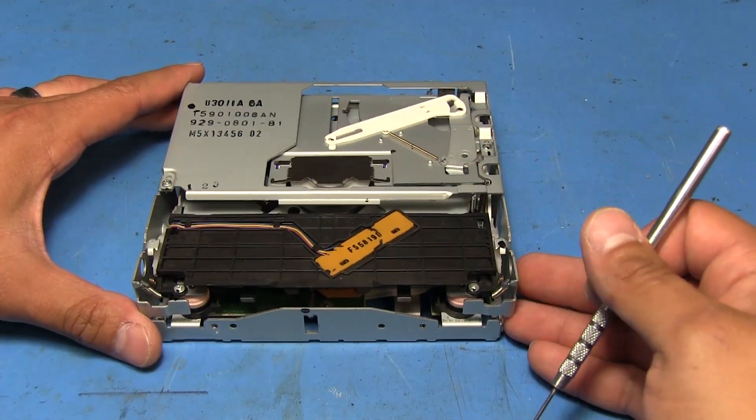To start, we've got to remove the top plate, which is held in place by just two screws. That comes off fairly easily — you just lift up and in the back it has two little clips that go into slots to hold it in place, so it just pivots up and lifts off. That frees the rest of the mechanism to come out of the metal enclosure.